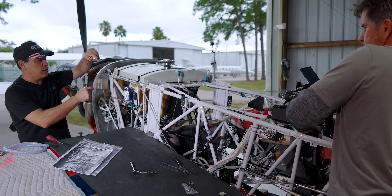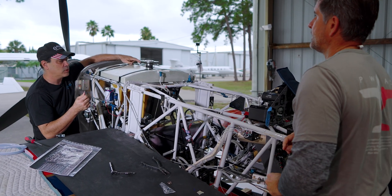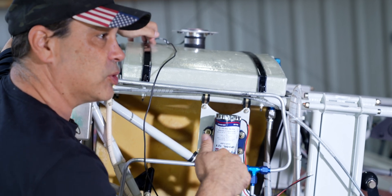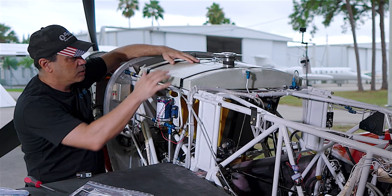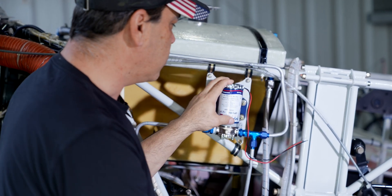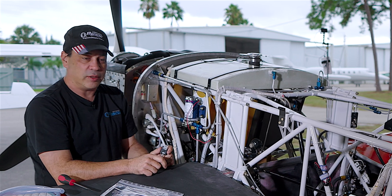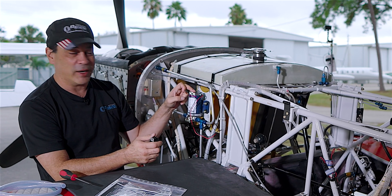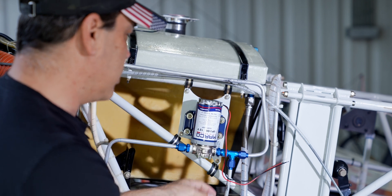The other thing we have on the tank up here is a sensor — almost like a float switch. It is a float switch. So when we're filling, we hit the switch back where Warren's wiring right now, and it'll fill from the bottom tank until it gets full, and then the float switch will shut off the system. From here we're coming out of the tank into this pump. This is a reverse polarity pump. We've got these relays, and based on the rocker switch in the panel — whether you're filling or arming or running the system — it tells this pump whether to run forward or backwards.